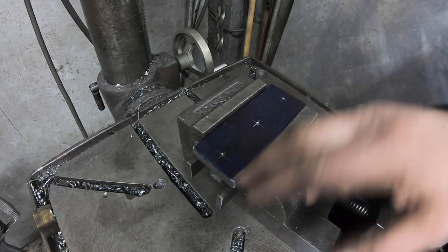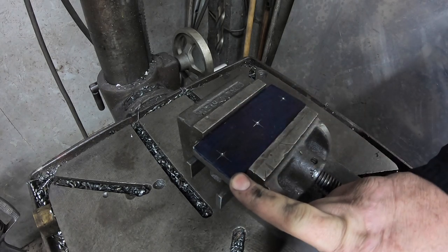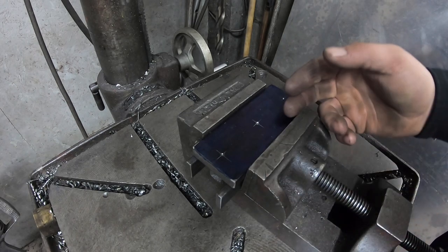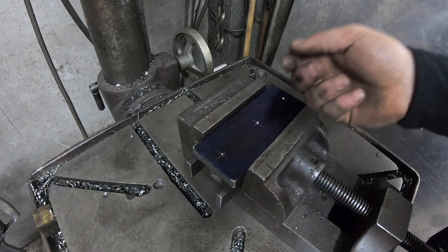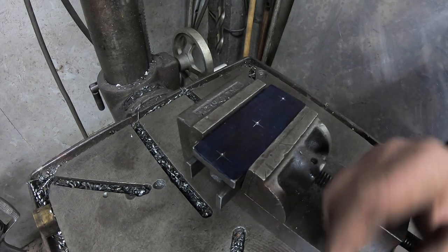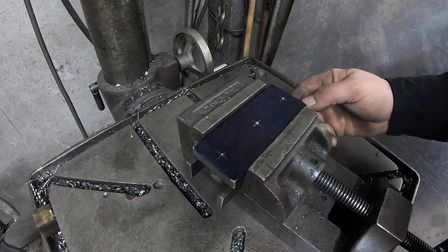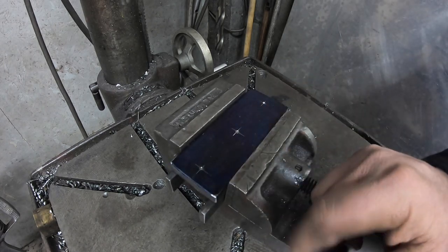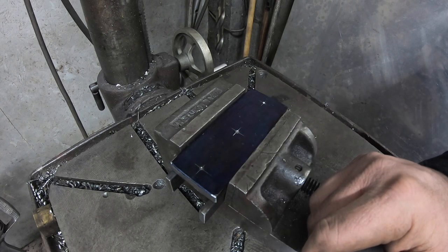It's 2-inch wide. This happens to be 1/2 inch thick, which is fine. It's actually going to work a little bit better because prying the old pin out, the head was kind of bending on me. So this is a little bit heavier. It's going to work just fine. It's not going to interfere with anything. So I just chopped it off at 5 inches long, and I just laid it out by hand and center punched it. We're not getting real critical on this bolt pattern.